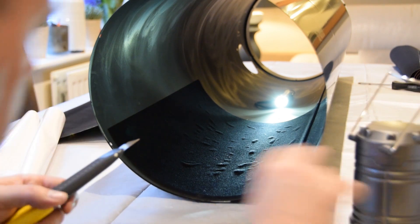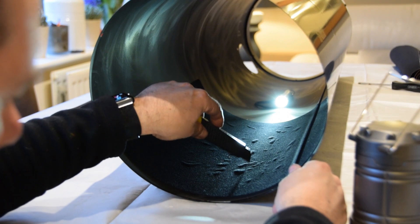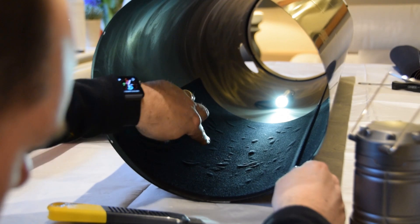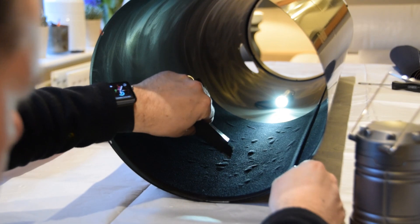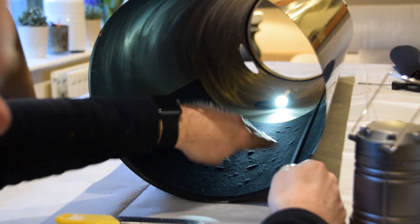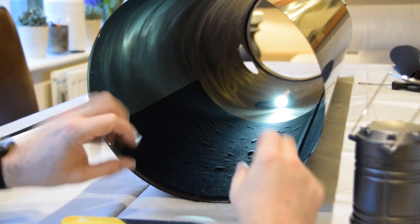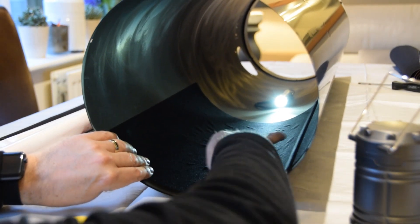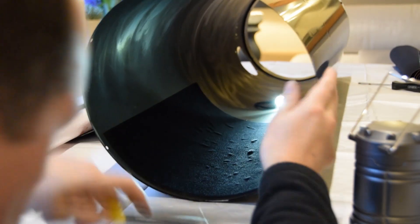The second section went on a lot better. I found that if I use the knife and just make a little scratch through the bubbles I can flatten it out really well. One thing it does say about using this material is to score it along its length when you've finished, because as the tube contracts and expands, the vacuum adhesive can actually come away from the tube if you don't do that.